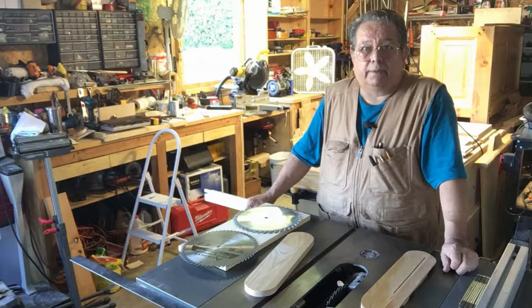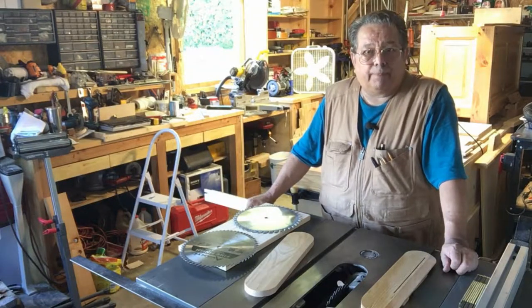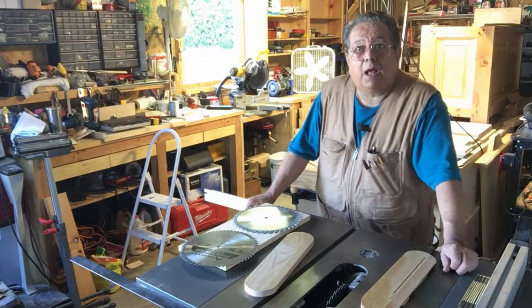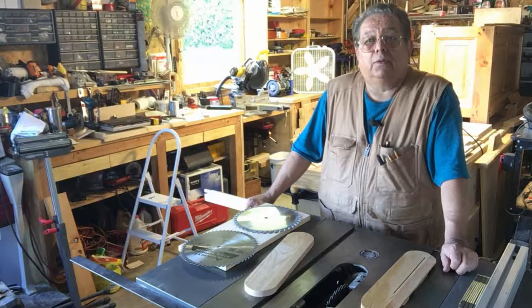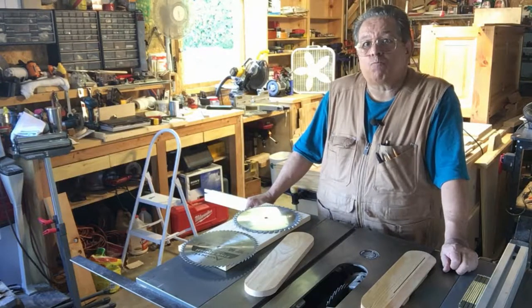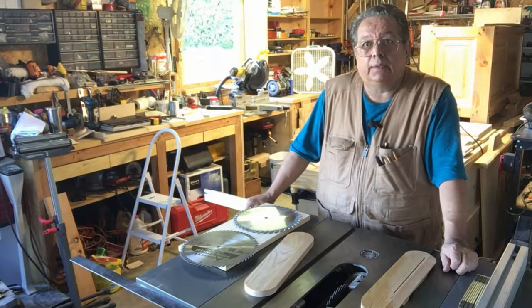Half inch is right on the button. And when I put my slot one panel for the big panel, so the machine goes in this one drawer, I'm having a 3/4 bottom. So I'm going to have a 3/8 dado for that panel to go in.